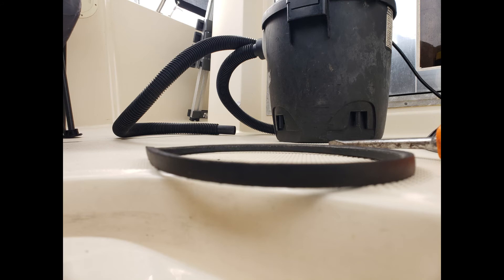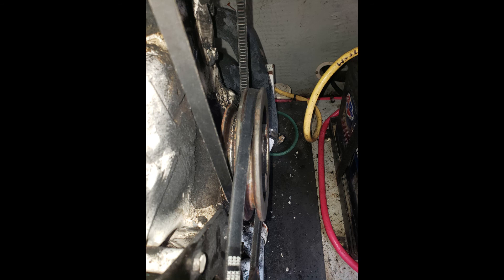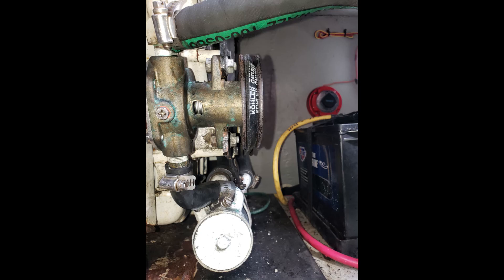That wasn't right, so I pulled them out and tried putting them in different ways. They ended up having a weird sideways notch, so it didn't work. I went to AutoZone and bought a couple belts that were 26 and a half inches with a deeper V and a rib, and it worked out great. That's an update on the Kohler 8EOZ 8KW generator.